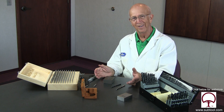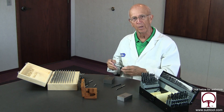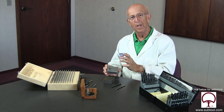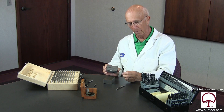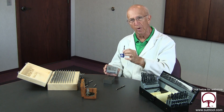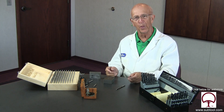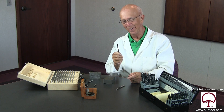I think it's amazing that there's that much complexity and difference between an inexpensive drill and an expensive drill. Not something I figured going into this video — that after putting a professional point on it, the cheap drill would drill on size closer than coming out of the box. Remember, the first one drilled eight-thousandths oversize — same drill, with the point out of the drill set. Next time we put a professional point on it with our machine, we come in here and it's within a thousandth of the drill size, but still one-thousandths undersize.